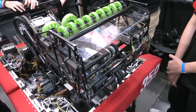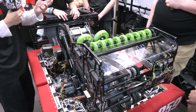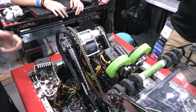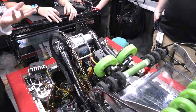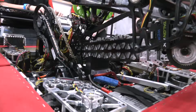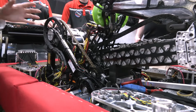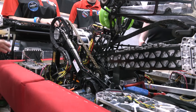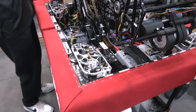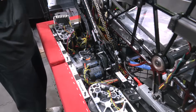Once we saw the game reveal, we had a strategy and design discussion. One of our first ideas was to try out the 2910 arm again and see how it would do. We had to make some changes — for example, we had to extend higher, so we made all stages of our arm around three inches longer, which meant we also had to make our drive base longer. That actually helped out a lot because when we're up high, we would probably tip a lot, but with the longer wheelbase it reduces the amount of tipping.